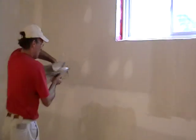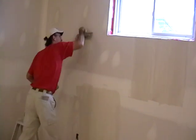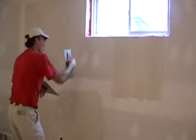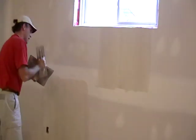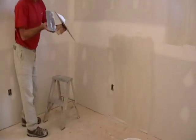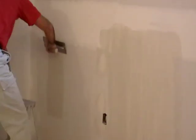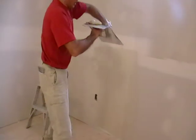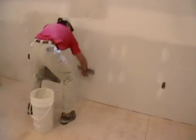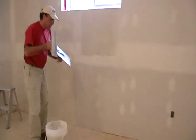So the next one I'll do the same - load up my wipe. If I'm going to leave a chunk of mud on from the back of my trowel, I've got to leave it over here. Tilt it right up and skim. Push higher, tilt the trowel up, and skim it off. You'll see you'll have next to nothing for the finished coat. Now here's the difference on the bottom of the screws - it uses only one stroke that way. One side of my trowel, which is for my back hand, is: load the mud up, let the trowel turn, kick the mud off. Those screws are coated. So let's quickly do it to these ones here too - load the mud up, put the trowel on, tilt it off. I didn't have to wipe my trowel in between because I was using the two different edges for the same job.